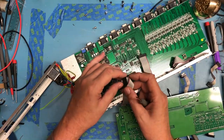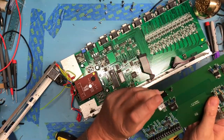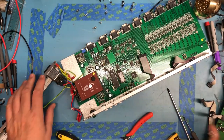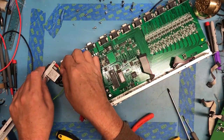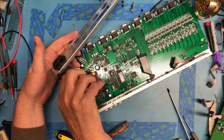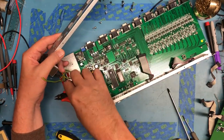So this is actually going into a DIP socket. It's directly soldered in on this side, the board, and then going into DIP sockets. So these ends here are definitely reusable. That's a nice little board. Let me see about finishing removing. I'm just going to clip the leads. It would be a major pain to get in there and undo that.